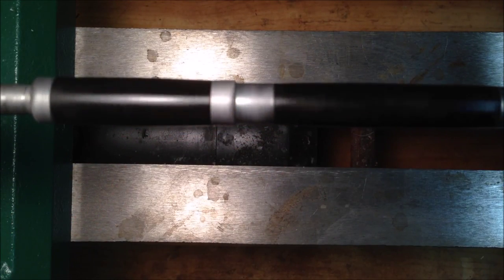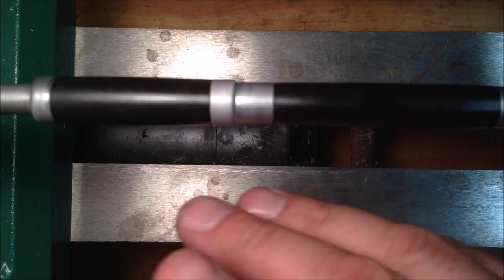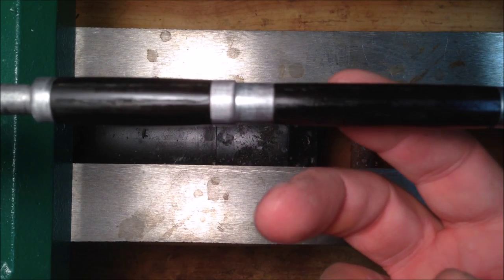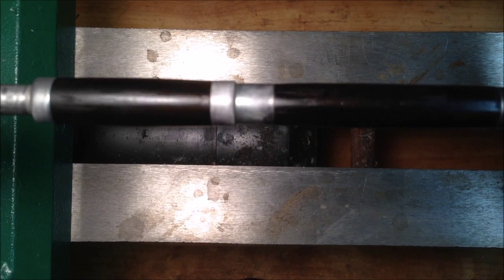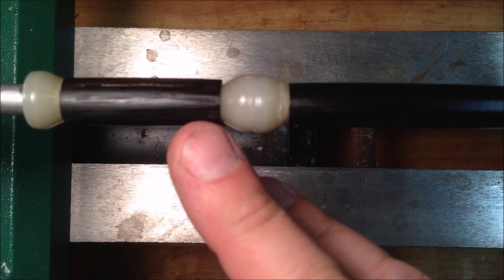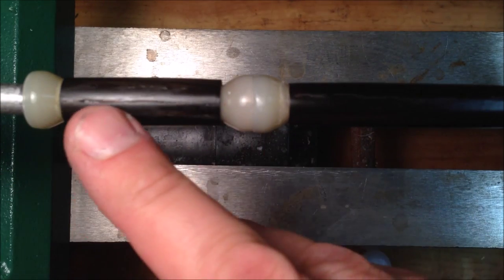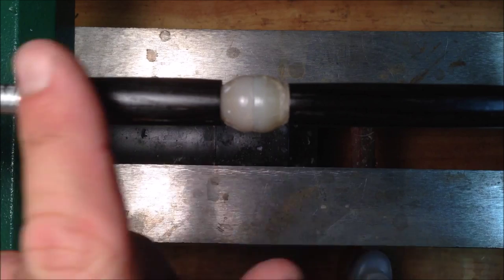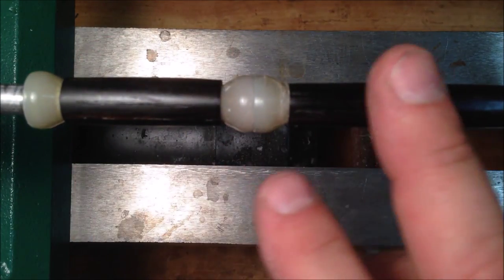I'm going to start applying some CA glue. One thing I forgot to do — I still have my turning bushings on, so I'm going to swap these out with my non-stick bushings once the CA glue dries. I've got one coat of CA glue on and already those spots of CA glue that were left are hidden. Normally I like to apply the CA glue to the towel then apply it to the blank, but since this blank still has some crevices, I'm going to be drizzling the CA glue on top of the blank with the paper towel below it — just to smooth it out — in hopes that a thicker application will fill some of those voids.